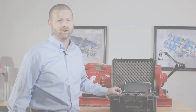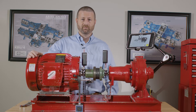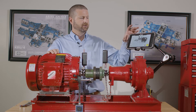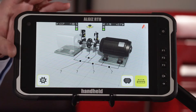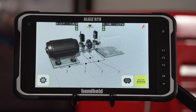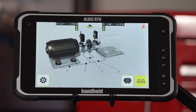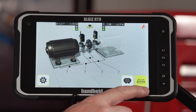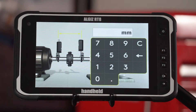Next we'll do an alignment with the AT100. Now that we have our pre-alignment steps completed, we're going to do a full alignment on this machine. One thing to note is that the orientation of the picture on the screen is from my perspective on this side of the machine, but with the screen flip we can reorient that picture — helpful for a user who may need to work on either side. Our guide-you philosophy means each next step is highlighted for you; in this case the green glowing icon is the next step.